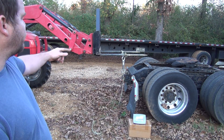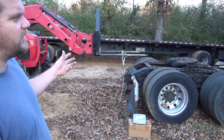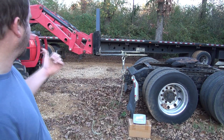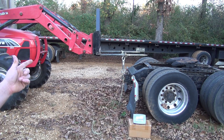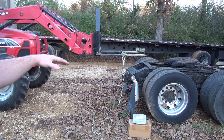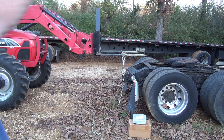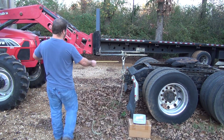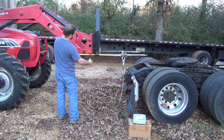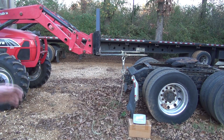I've got my Mahindra 8560 here, which is what we'll be using to test. It has an ML 283 loader — I think the mPower has the same basic loader. I have an 1,800-pound bush hog on the back as well as water in the tires; it's a Land Pride RCF 3696. I want to see what we can pick up at five feet level. This is also pretty close to how John Deere rates some of their loaders — 800 millimeters forward from the pin, which is 31 and a half inches. We're a little further forward than that on this particular test, so we'll see what kind of numbers we get before moving the chain back.